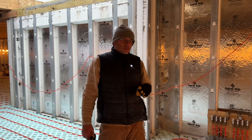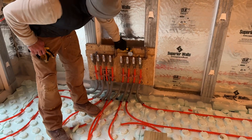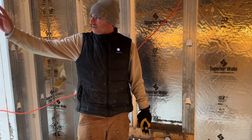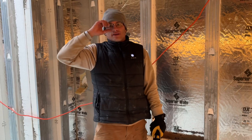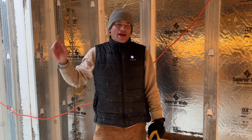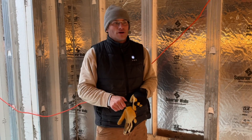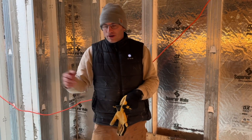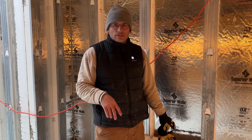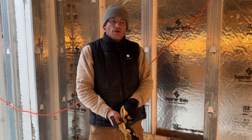It's a little loud because we ran out of our generator, but as you can see, we hooked up all the manifolds and pressure tested them. I'm at 50 PSI. The four-zone manifold is good and the one-zone manifold is good — we're almost done. We probably have another hour to finish up testing. Tomorrow the concrete guys are coming to start prepping. We're two and a half days in on this PEX install including installing the manifolds. We'll finish this up tomorrow and recap how we installed all of it.